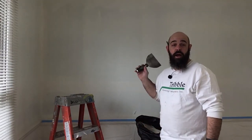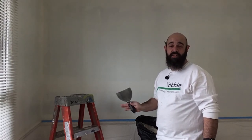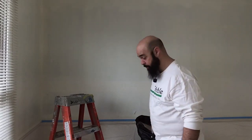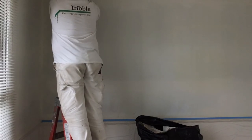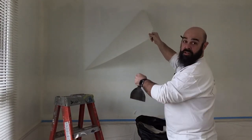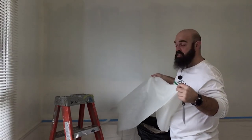I waited about five to ten minutes with my first coat and then re-wet it. Patience is the key here — if you rush it and get into it with a knife too quickly, you're going to end up causing damage to the walls that you'll have to repair, so you'll really just be making more work for yourself. Once you've given it enough time to do its job, we can start removing the backing. Just like that — if you give it enough time, the backing will come off just as easily as the paper did.